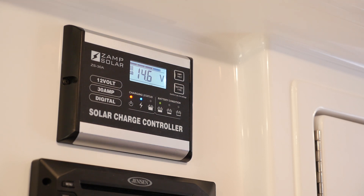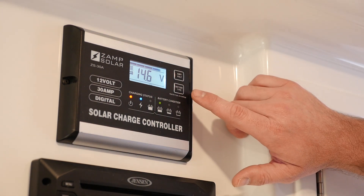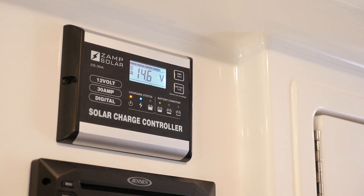There's one other button — the battery type button. You shouldn't normally need to change it, as it's already been preset based on the type of batteries installed at the factory. If you replace your batteries with the same type, no change is needed. However, if you're switching from AGM to wet cell, AGM to lithium, or vice versa, you would need to go in and change this setting so the solar system knows how to properly charge that battery bank.